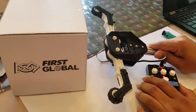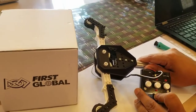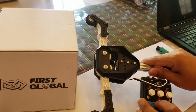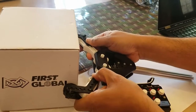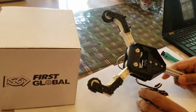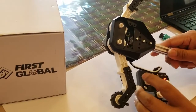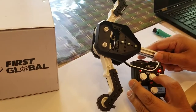Now we're going to program the arm to have the right grip positions. If you notice, the test was flashing with the program light. When I hit test, all the lights go out. When I hit test again, it goes to two positions, but those positions aren't gripping yet. Hit test one more time to go back into program mode at center. Now I'll adjust the arms to the point where they're actually gripping the block — maybe making it a little smaller. I push the right button, and when it lights up, that position is programmed. Now I open it up and hit the left button; if the lights come on, that's valid. When done, I hit program.